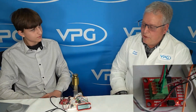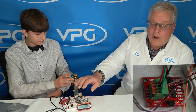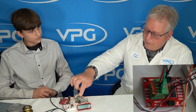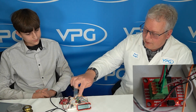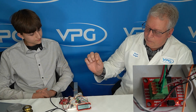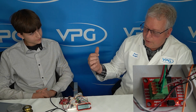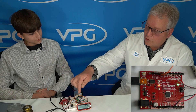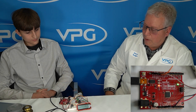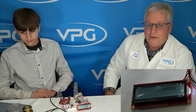We'll run through a calibration cycle on this and get it reading. The QuikScale is 24-bit resolution, so it takes the analog input — a very small voltage signal from the Wheatstone bridge — provides excitation to the bridge, and does the analog-to-digital conversion. That goes direct into the RedBoard and we've got an LCD display to show our results.